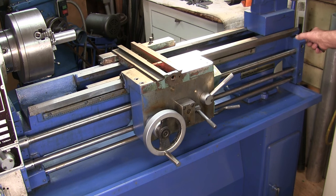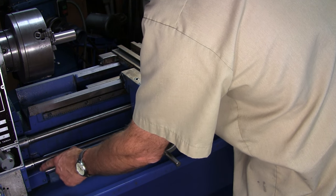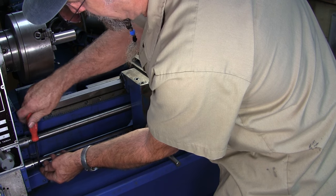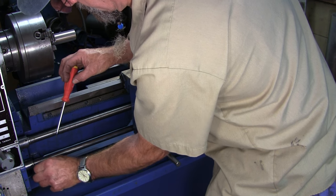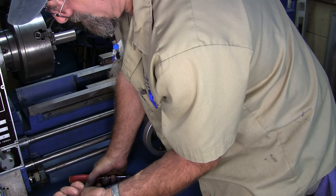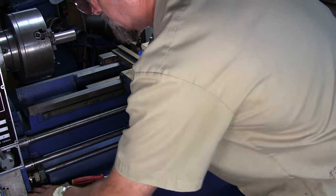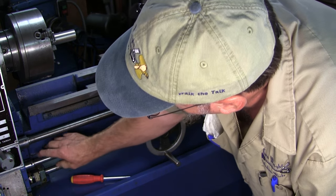The rods are supported at this end by a guide block or bearing block and tied in up at the headstock feed box with two roll pins and a collar, plus a roll pin going in for the switch. I'm going to pull the cover off the switch because it'll let us punch that roll pin out — otherwise the shield is in the way. Another reason you want the power off is what happens if you touch metal against hot leads. There are little grubs on there, so we'll want to clean that out.